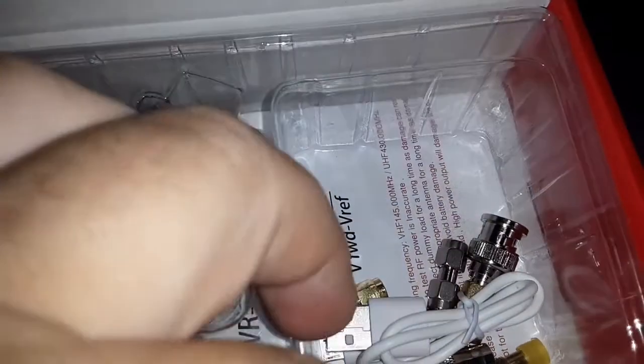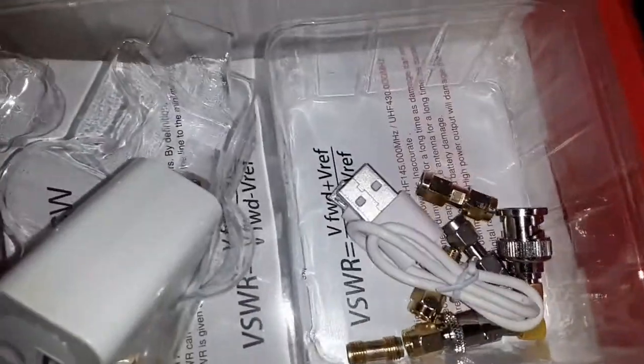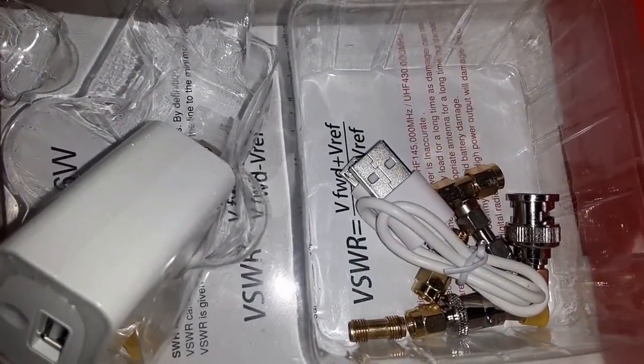Okay, so I'm going to need the meter, a coupler, and then I'm going to need that dummy load. Let me dig everything out. I get everything kind of scattered here. Okay, I'm on 223.500, and we're going to try the low power setting. 1.4 watts. Not bad. Let me spare you me fumbling with the video. I'll get to high power and I'll be right back.